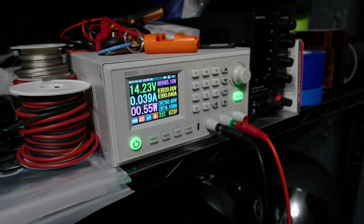But this is all to say that should someone recommend to you, if you have a dead battery, totally flat, if they recommend to you, oh, I think you can recover it, you should try to recover it, you can charge it outside of the BMS so that way you can revive it, just don't do it. Your personal safety is not worth it.